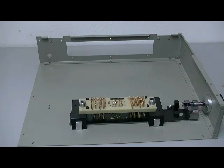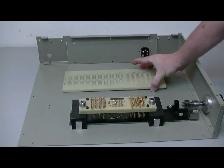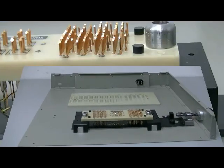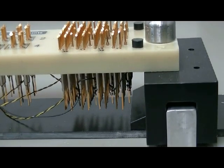The real flexibility of a docking station is its interface. What it does is create the conditions that the same docking station can work with almost any test equipment. Any test system that uses Mac or Virginia panels or ICT platforms like Z1800s, test stations, and Spectrums can all be directly wired to a docking station interface. This now creates the condition that a low-cost cassette can replace a dedicated fixture for a fraction of the cost.